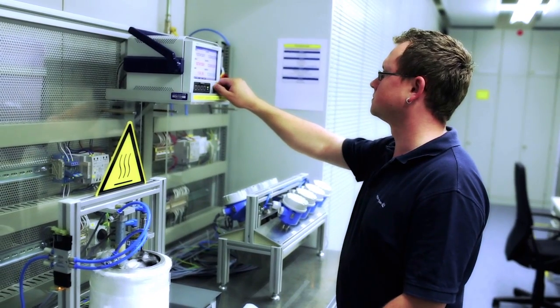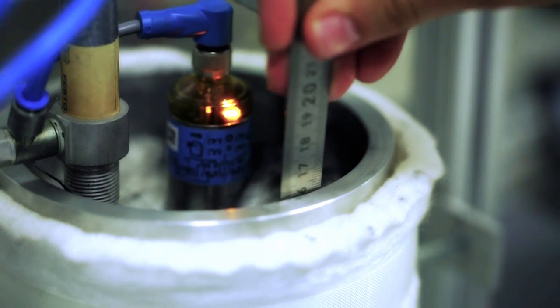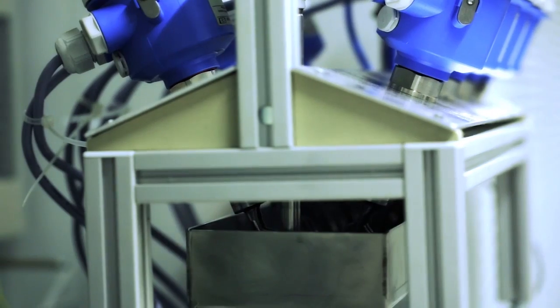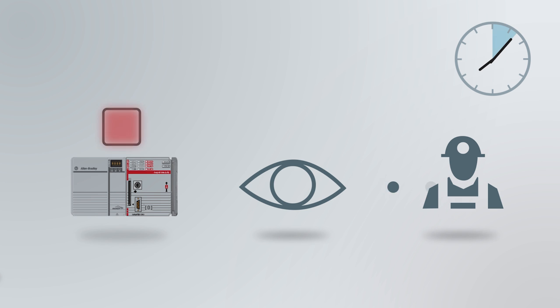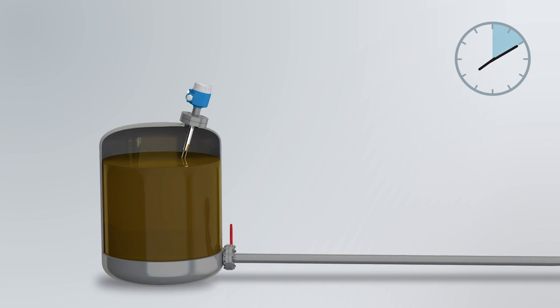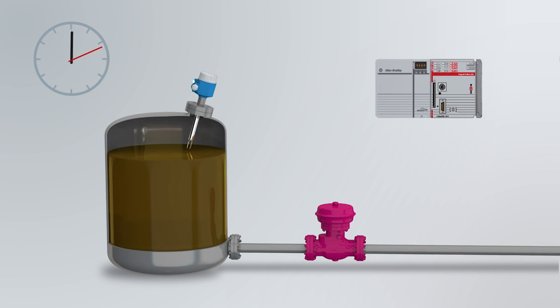Increasing safety and efficiency are not the only advantage of the overfill prevention system. Implementing an automated overfill prevention system can reduce your response time, for example, from 20 minutes to 1 minute, compared to a manual overfill prevention system which relies on human interaction. A 20-minute response time for a manual system includes communication time between detection of the alarm and notification of staff, time to analyze the situation, time to complete countermeasures such as closing the valve, time to verify that the process is in a safe condition, and a safety factor as described in API 2350 — whereas an automated overfill prevention system typically closes the valve in less than 1 minute.